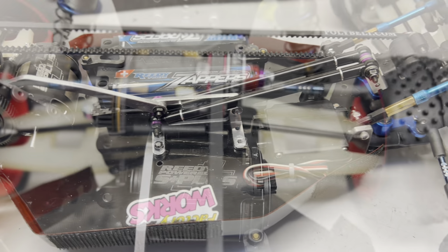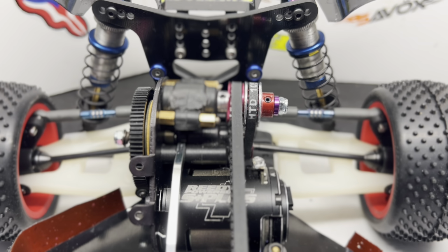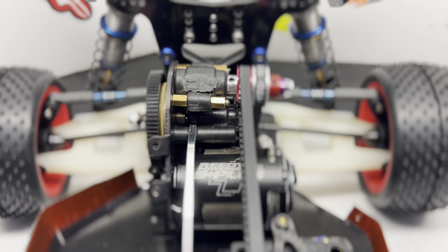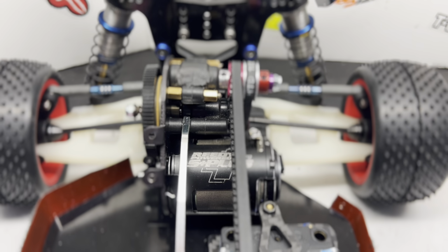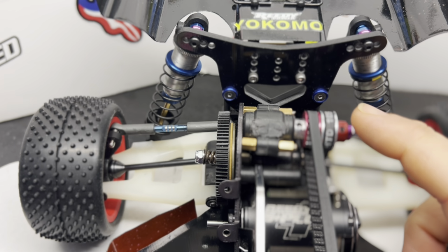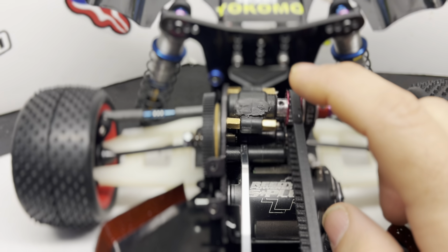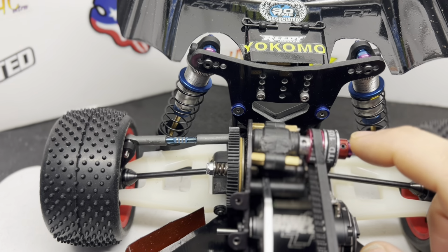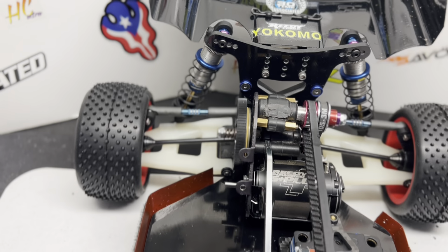So it works out. As far as pulleys, I use FingerTech Racing pulleys. I think it's a company that makes parts for drones and stuff like that, and I think battle bots. What I like about these pulleys is that they are a little stronger than the Sakura pulleys that I used before. And they use a 440 grub screw to hold the gear in place.